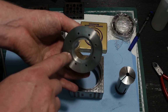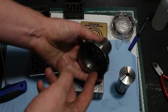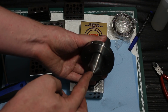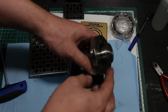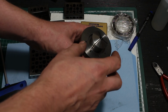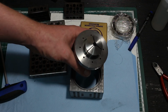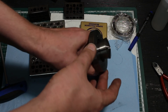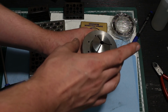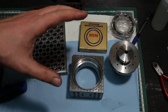The spindle itself is this part here. It's hardened. I already hard turned the face, this OD here, and hard turned the ID with CBN tooling, and then I lapped it to a very close sliding fit of a 5C collet. Obviously there is no 5C taper here. The 5C nose will be an additional part that bolts on with this 8-hole bolt pattern, and has an adjust through feature, 4 screws on the perimeter of this part here. That allows me to push the 5C cone around and dial the part in the collet in perfectly.